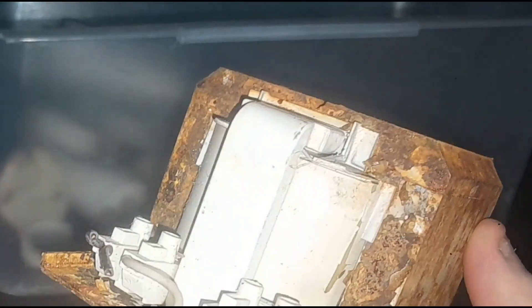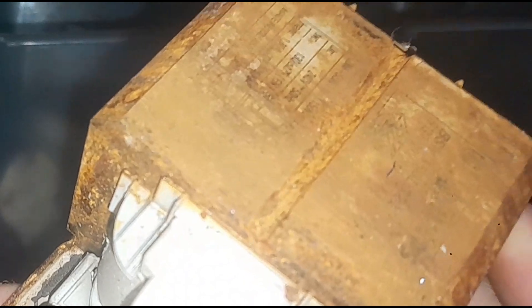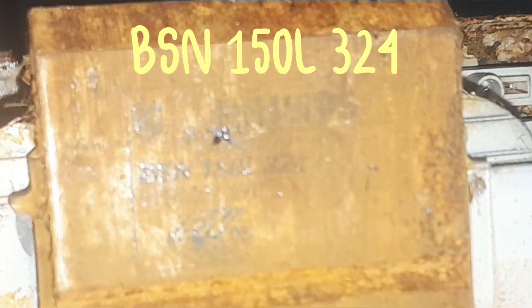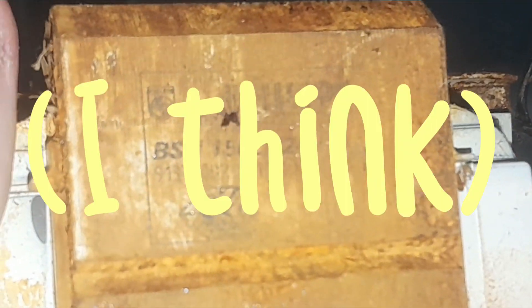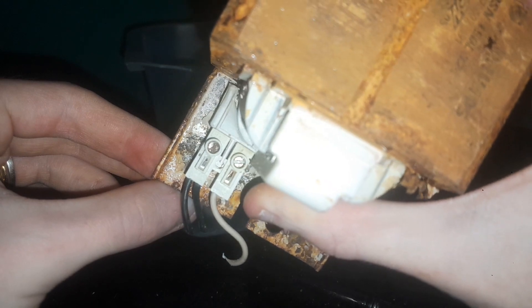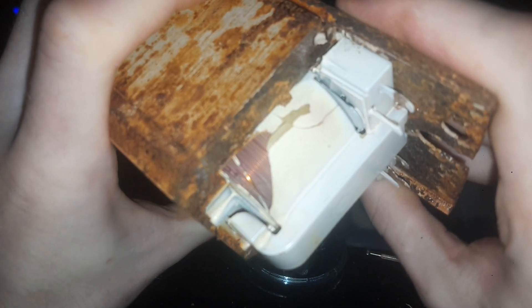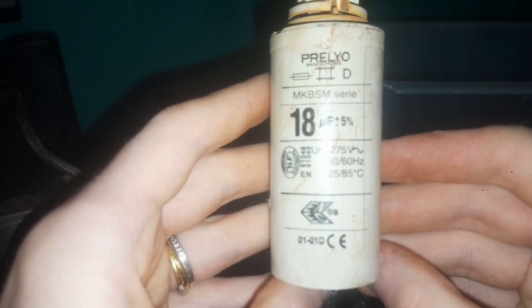Now for the ballast, which again has a nice coating of rust. From what I can make out of the text it says BSN 150L324, however it is quite difficult to see. Apart from these rusted wire connectors, the ballast seems okay and most likely still works. These things last very long — about 15 years — however most seem to live much longer than that.